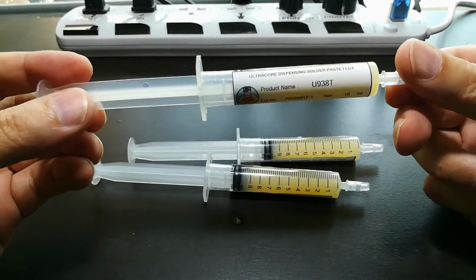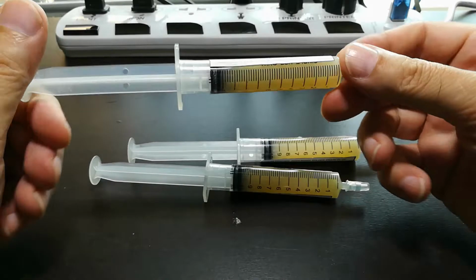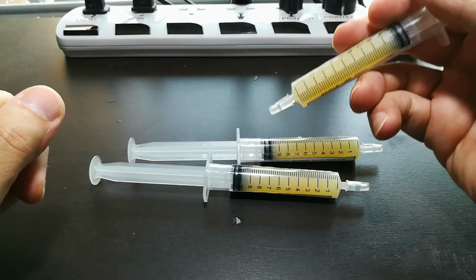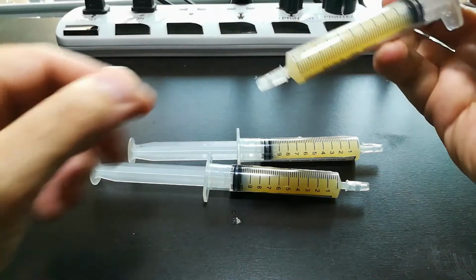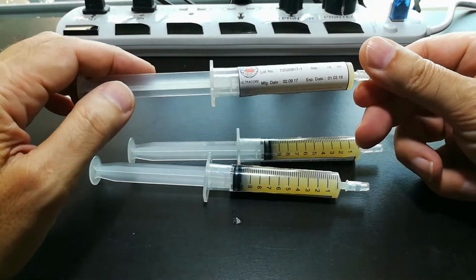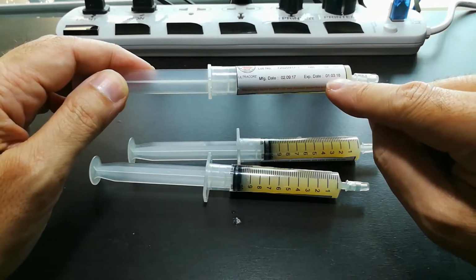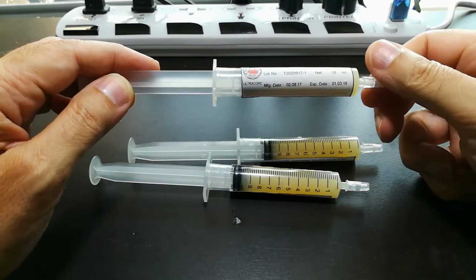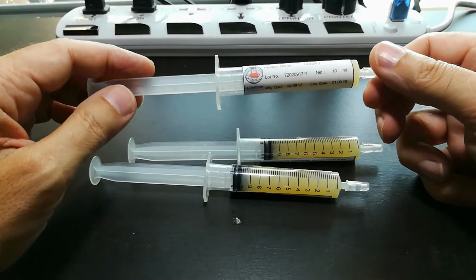So they actually sell this kind of flux, which acts as a cleaner, in a syringe. So you can very gently squirt a little dab where you need to go onto your potential connection, then come in with the soldering iron and solder it up. So I figure it's good to stock up on a few of these. It even has an expiration date, which is almost ready to pass, the 1st of March. I'm only about 3 days away from the expiry on this, but I think I will tough it out and try and use it anyway.